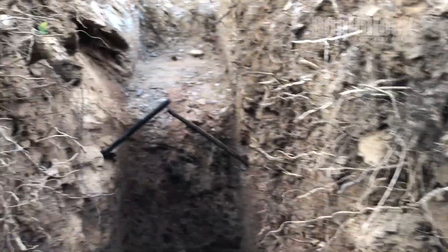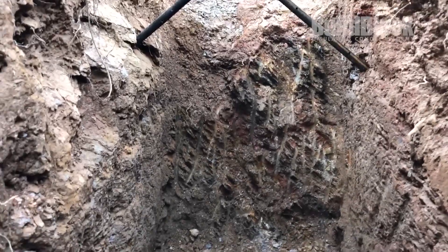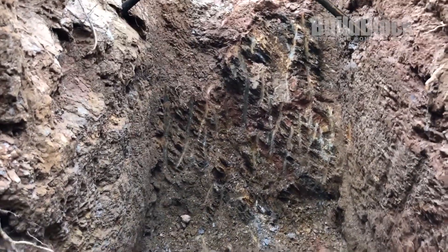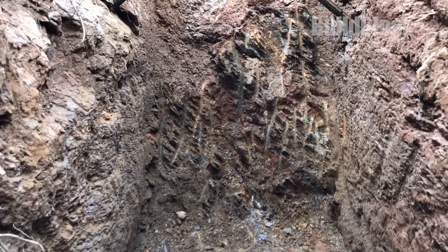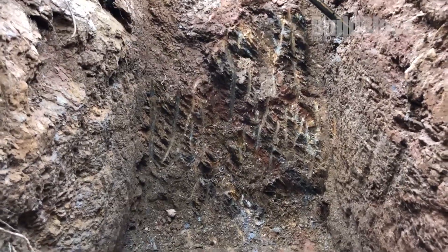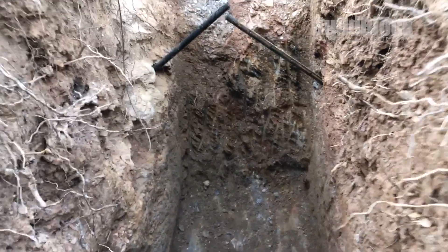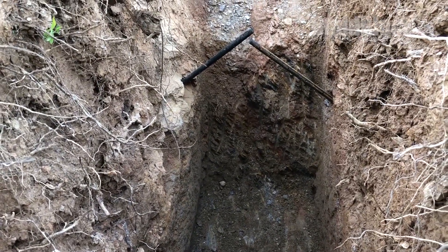Turning the corner here and looking the other direction, here is a close-up where you can see I've had to take a rock drill and a hand pike — like a mini pickaxe — and actually chisel away at that rock. You can see the grain there. I'm chiseling it away to get it cut back far enough so that I have a good thick bulkhead for the vertical part of the footing here.